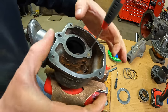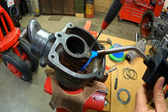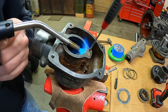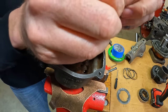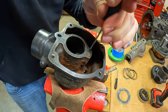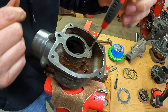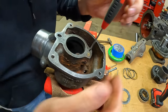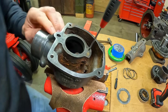They'll offer you a bite without expanding it out and tightening it in the bore even further. We're going to try a little bit of heat on this as well. Can we get any movement at all? I'm telling you already, if this doesn't work we're going to have to drill and re-tap. I'm certainly not going to twist hard enough to snap that Torx bit off in there — that would really be bad. No, I don't think anything's going to happen with that; it's pretty tight.